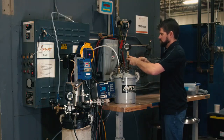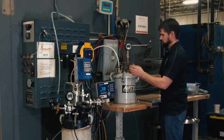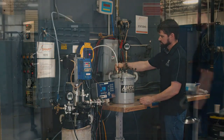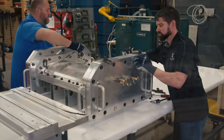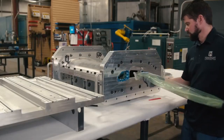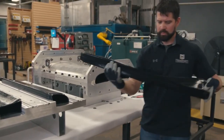Once complete, the exit and inlet lines are closed, allowing the pressurized smart tools to create a hydrostatic force to consolidate the preform and voids during cure. After the cure is complete, we remove the mold from the oven and disassemble both end plates. Next, vacuum bags are removed from each cavity and the elastic smart tools are extracted with low force from the cured composite part.